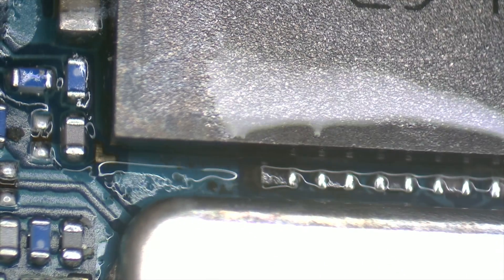Here's another important tip. In the presence of damaged components in critical areas like the CPU, memory, or PMIC, it's essential to perform precise measurements to identify their nature. If it's a capacitor on a vital line, its removal might be crucial for the motherboard's operation — then it is replaced with a new one. The primary goal is to recover the proper functioning of the motherboard. We encounter a component whose connection to the motherboard has been severely compromised: we remove it and proceed with cleaning the area, as one of the pads has lost connection with the motherboard.